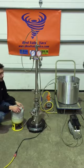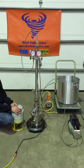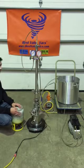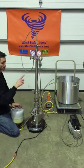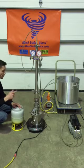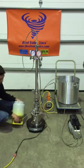This tank is probably near empty. If you have a larger tank or system, you can flip on the MT69 at this point — it provides a vacuum pull of about 10 to 22 inches of mercury, not a complete vacuum but enough pull to help draw solvent out of the tank. The only problem is if you open both valves, it doesn't know it should pull from the tank, so you have to toggle the valve to get it to suck and pull through. Once you see solvent flow through, you know you have enough in the system. I know there's enough, so I close off the blue valve.